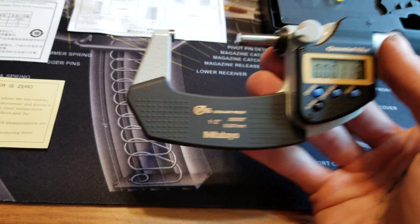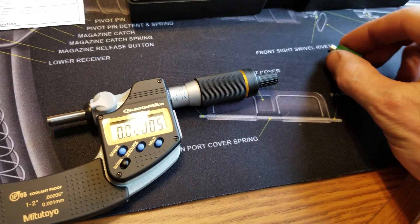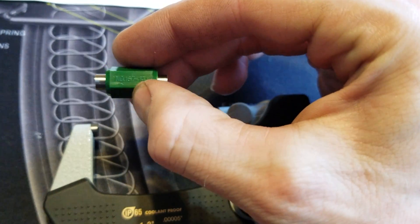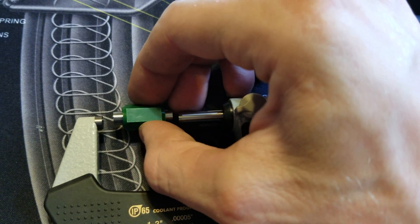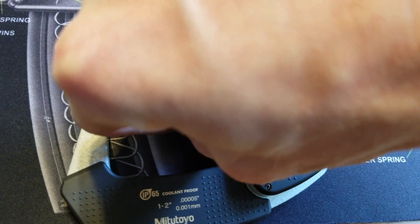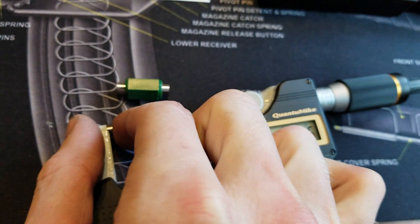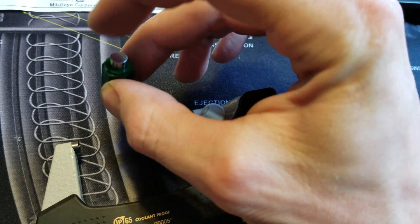The button origin is arguably one of the most important buttons. Take this one-inch standard and put it in between the two carbide faces. Make sure you wipe every surface of dust, because even the smallest particle of dust is definitely going to alter the accuracy of your zero.